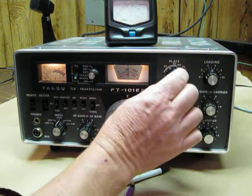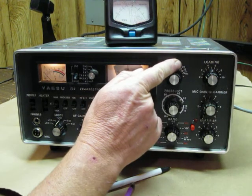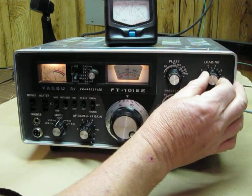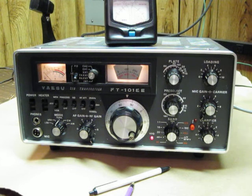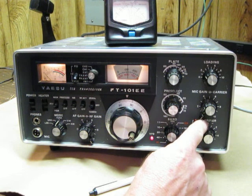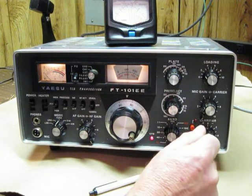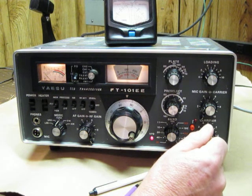We need to set this to 20 meters — the indicator up here shows you the 20-meter position. Then we need to set this rheostat or tuning control to approximately 50%. Now we're going to start to tune this radio. We want to turn the carrier gain so that we have the least amount of power going out into the antenna. Do not turn it more than just a little bit at a time to bring up the power. We're going to focus on the meter here, and I'll talk you through how we're going to adjust that.